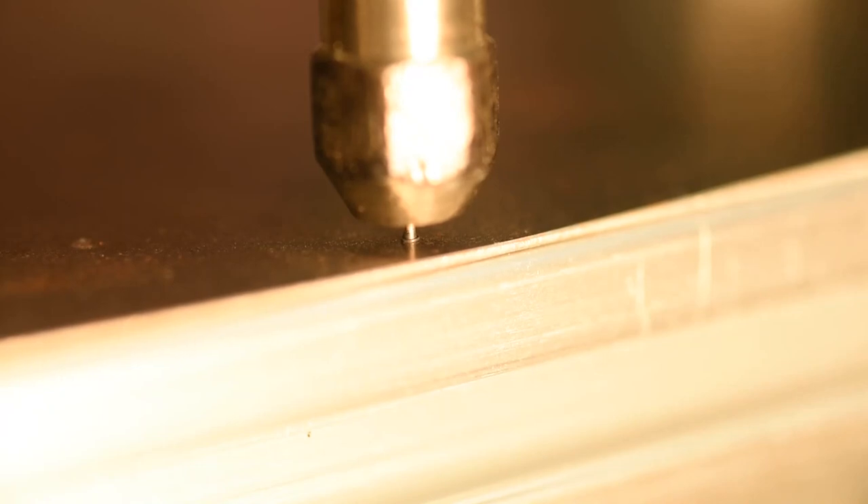This is just a quick test of 0.6 mm 14 karat gold being deposited on mild steel at 30,000 RPM. This is 0.6 mm diameter gold at 75 mm per minute, and at a XZ feed ratio of 80 with a plunge depth of 0.125 and a track width of 10 mm. So here goes nothing.